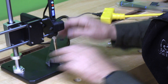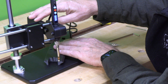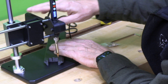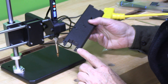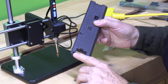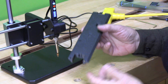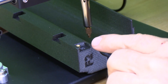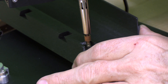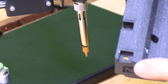Let's put another one in over here. There we go — that's it, that is melted and secured. You can place them flush, but sometimes a little ring of the filament will raise up, so you need to be sure that's flat. Or you can set those in slightly below the surface and there's no way they're going to interfere. One little trick is you can put the threaded insert in the corner, get the heat tool to get it, then drive it home — that puts it in really nicely.